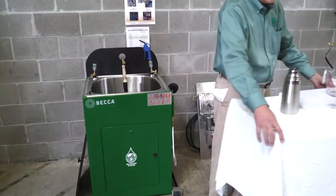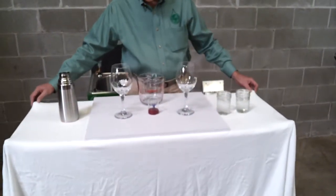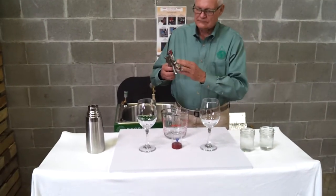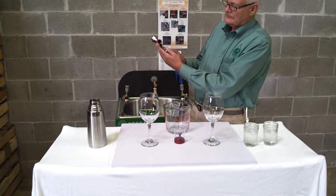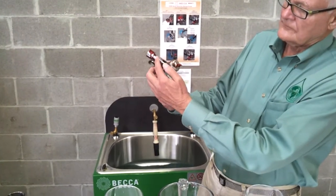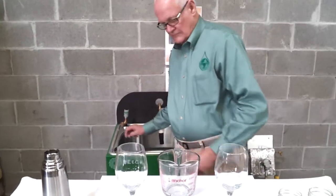In a liquid state, most waterborne paints are reasonable to clean. Reds and whites for all waterborne paints are finely ground to provide better coverage, which also makes them more difficult to remove during the gun cleaning process. Any dry material around spray nozzles or air caps, which is often present, creates a difficult challenge to clean completely. Once waterborne paint is dry, it cannot be reliquified.